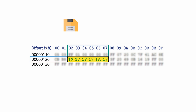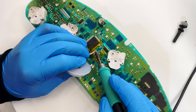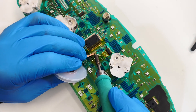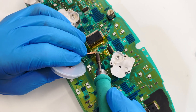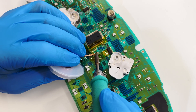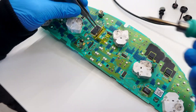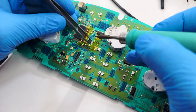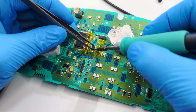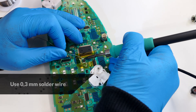Save the file just modified and upload it on the EEPROM. Unclip the EEPROM from the programmer. Before soldering it back, remove the thin excess solder from the PCB with a soldering iron with chisel tip and a solder wick. Clean with some solvent. With the tweezers, position the EEPROM on the PCB as it was originally, and solder it using a soldering iron with conical tip at 350 degrees.